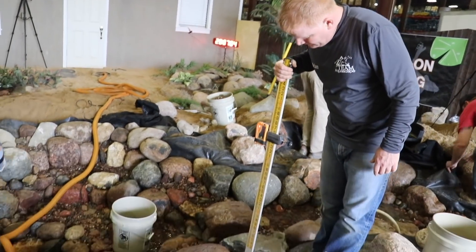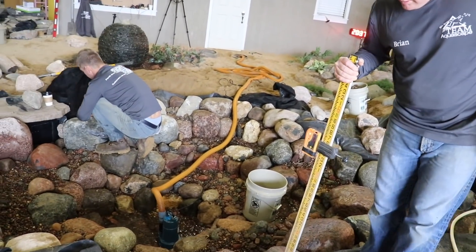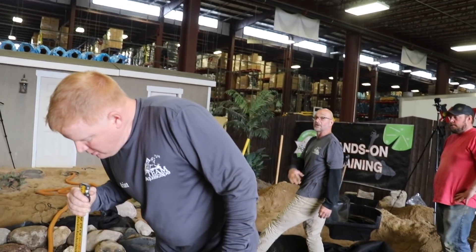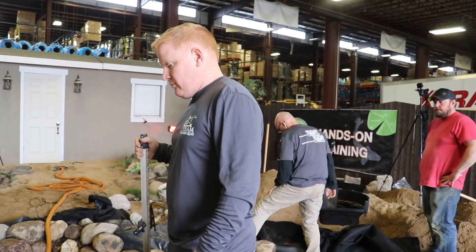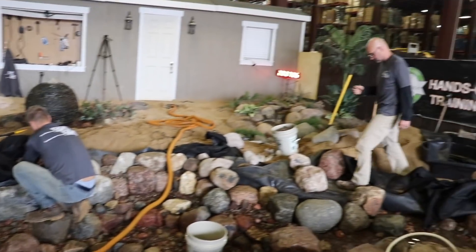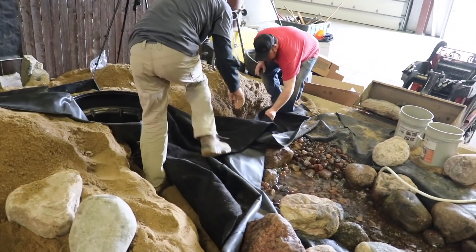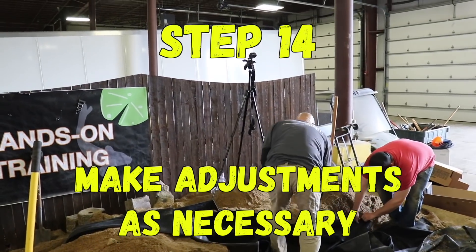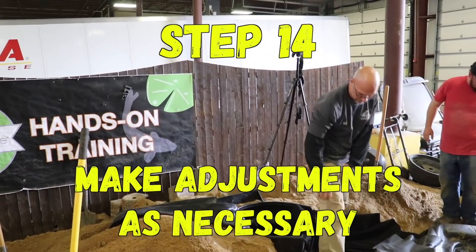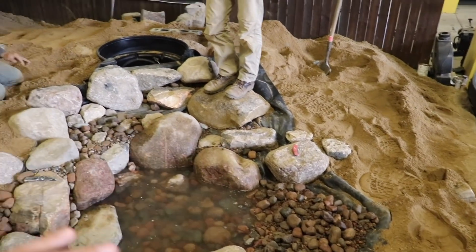Brian's checking all of the water elevations so he knows right where his water level is going to be. Worst case scenario, you could drop the water down a bit — with the adjustable face plate, you could drop the water elevation down by about an inch for security, and it wouldn't really impact what's going on out here. We manually raised the elevation — peeled the fabric back, put more soil in place, raised it up that way, and got our comfort zone established for the overlap.